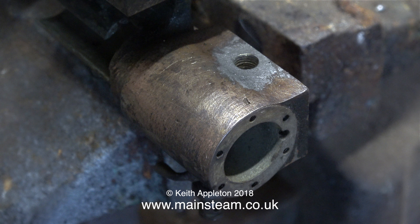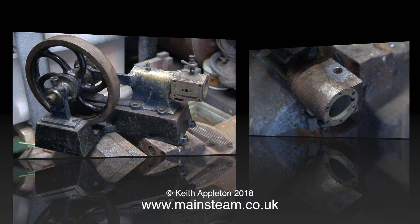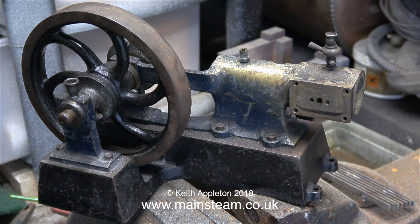I can see that there is a thread down in the hole, so obviously whoever worked on it didn't have the facility to thread a piece of pipe, so it was easier just to put a piece of pipe in there and soft solder it. I'm going to use a 90 degree elbow at this point and make a proper exhaust system.